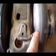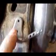First thing I did is right here. This is the controller for the collar. The electronics has been removed. I put this little arm on here, and you can see it's got multiple holes in it, so I can fine-tune my spring pressures by using different varying radius here. So that's how that works.